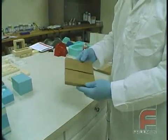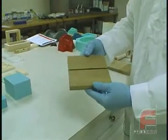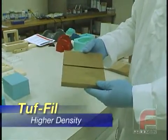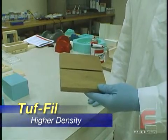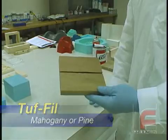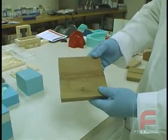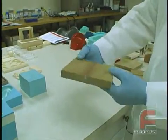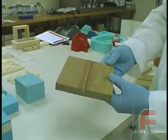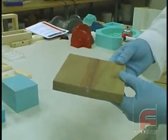Here is a piece of Honduras mahogany that needs to be repaired. For this job, we are going to use Tuff Fill — a denser, harder, and more abrasive resistant repair material which better matches the qualities of the mahogany being repaired. We are applying this material using the same procedure as the Tuff Carve repair. Once solidified, our unfinished application looks like this. Although harder than Tuff Carve, Tuff Fill can still be worked with sandpaper.